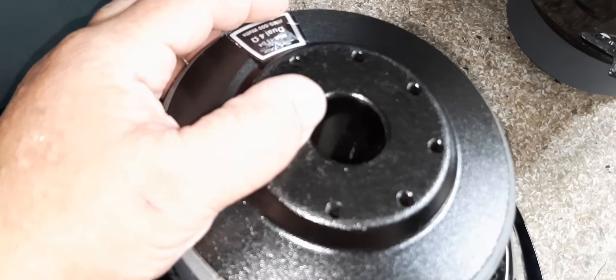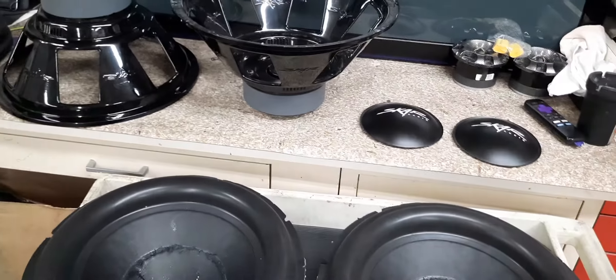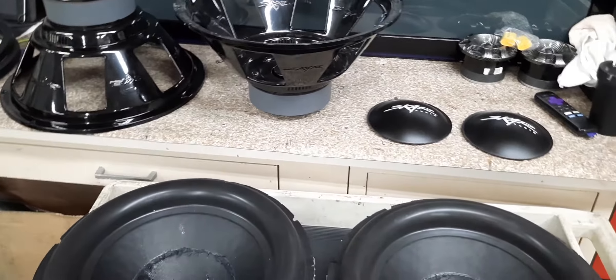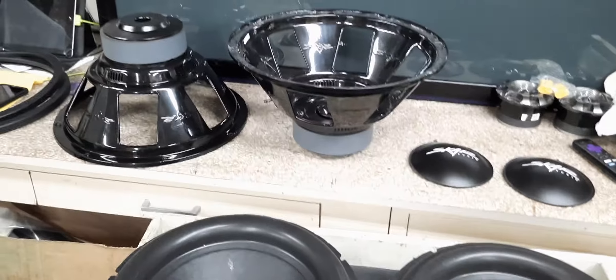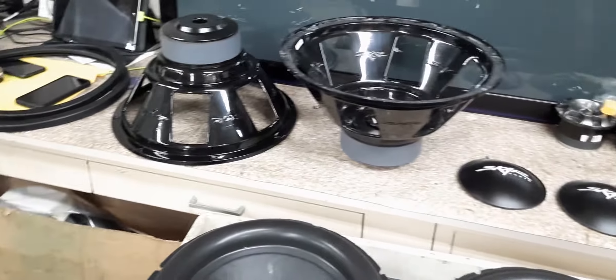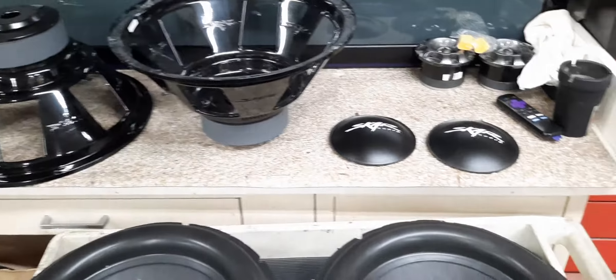I guarantee the coils I put in will be able to handle a little more than 600 RMS — they'll probably be handling like 800 to 1000. They won't be able to extend any further because they have the same winding height, but they'll just be a more durable coil — they won't burn out as easy as somebody burned these out. The SDRs look like you can really send a lot of power to them when they're in the box, not realizing they don't have much of a motor. The PSI coils I'm putting in are just going to be a teeny bit better. Alright guys, peace out — SCAR to the head!